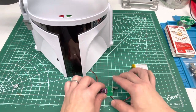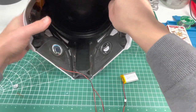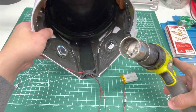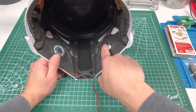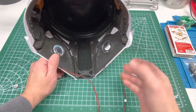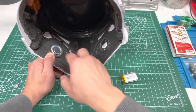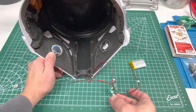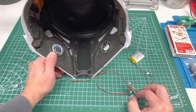Here's what it looks like on the inside. I used a tool to drill out these holes evenly, and then I mount them both in there. This one, as an exciter, actually has tape on the front so it'll adhere to the helmet and turn that into the vibrating surface that makes the speaker. The more vibration surface it has, the louder it is. This is the tinny one — there's a two watt and a four watt. The amp is three watts, so if I turn it up too much, this one starts jabbering and gets a little squealy. So I just don't max it out.